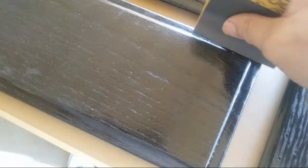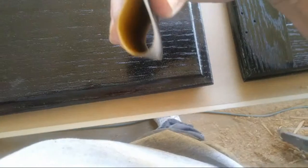All right, we're not sanding at all. We're just removing the roughness off the door so it has a smooth surface as an end result. All right, going in the same direction. Okay, again, I've got this built-in cushion right here. All right, and then I'm just going to bring it down. Pressure's on the back side, and I'm taking the contour of this finger pull, and we're moving the sandpaper forward.